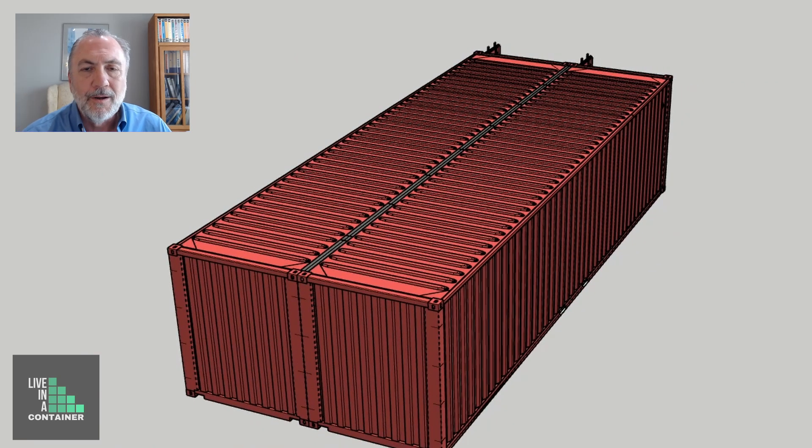In order to put a roof on there, we're going to frame it with 2x6 trusses. These trusses will need to be connected to the edges of the shipping container, and we don't really want to penetrate through the shipping container any more than we need to.